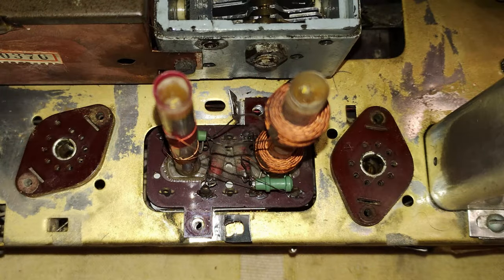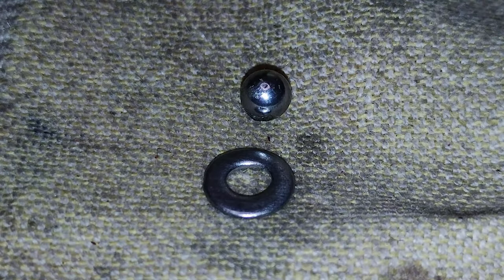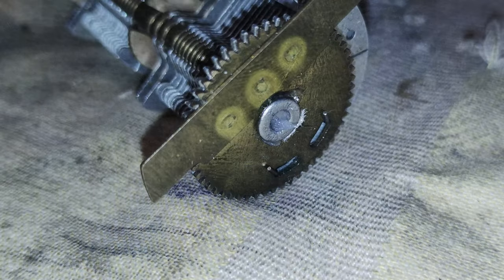Unfortunately, releasing the nut and the screw on the back was not enough because there isn't any pressure from the opposite direction. Therefore, the rotor was removed to find a way to obtain such pressure. The idea was to put a thin spacer before the front bearing. A very bad idea, actually, because such a spacer should have been thinner than 1/10 of a millimeter.